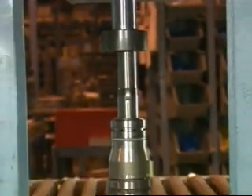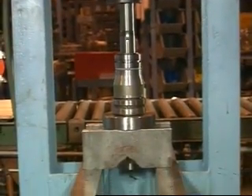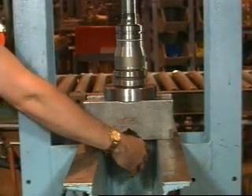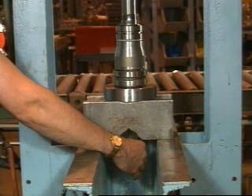For 15, 30, 60, and 130 series pumps with bearing spacers, use a hydraulic press and V-blocks to remove the bearings and spacer from the shaft.